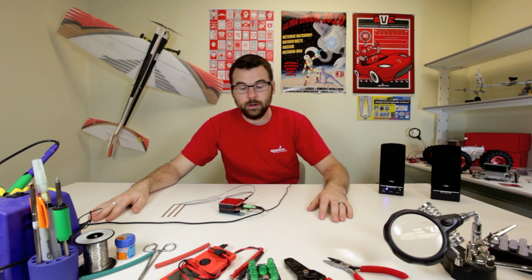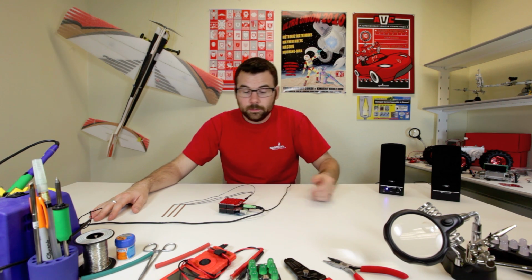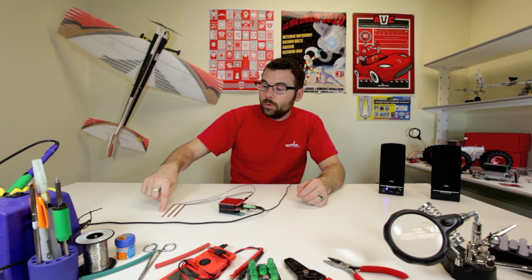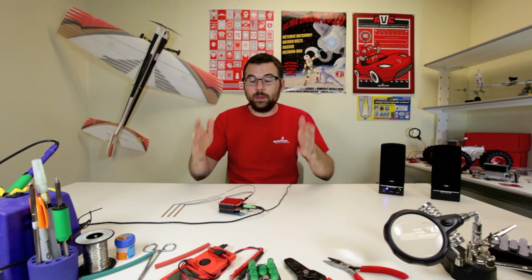We've got a little demo hooked up with the musical instrument shield so we can see what those two look like together. So here we've got everything hooked up. We've got some computer speakers hooked up to the output of the musical instrument shield. We've got power plugged into the Arduino, and we've got the musical instrument shield stacked on the Uno with the touch shield on top. On the table, we've got the copper tape laid down onto the table with wires going back to the 3 broken out pins on the touch shield.